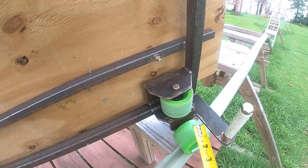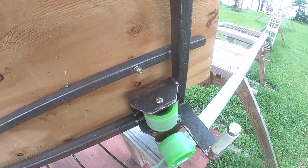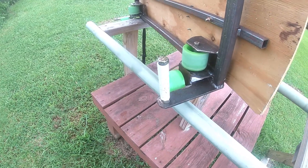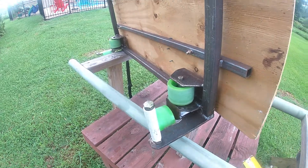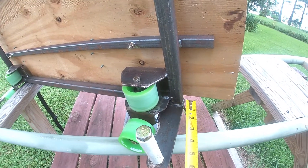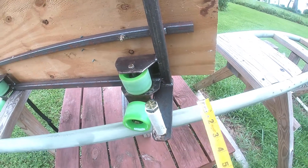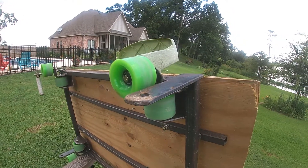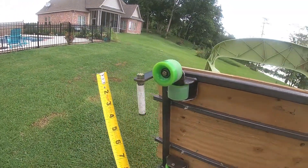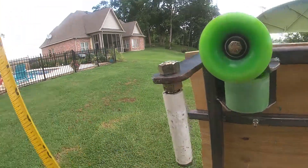You have these side wheels that keep it horizontally on the track, and these are the wheels the cart runs on on the track. This thing right here is supposed to keep it from flying up off the track, though it's not really needed. It was placed six and a half inches from that frame right there, but it really needed to be maybe seven and a half inches. I had to take off a couple of these wheels so it wouldn't bind — I took off this one and this one, but I did leave these on just in case. This is just a piece of tubing on a half inch bolt with nuts on both sides.